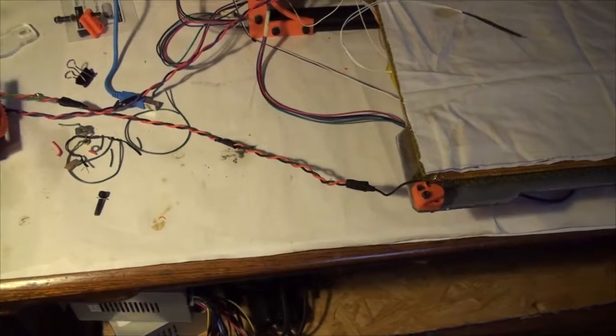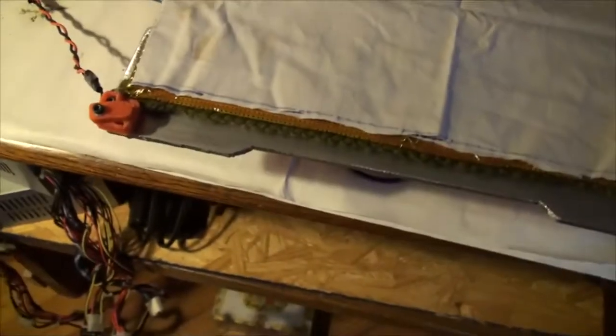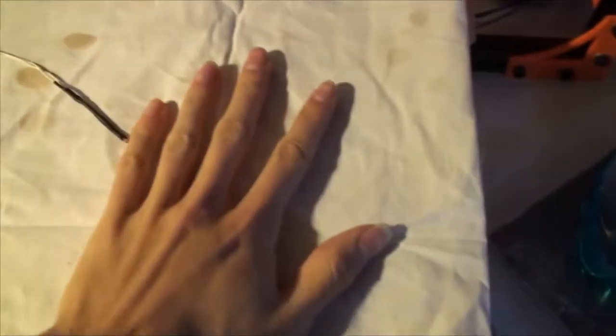Okay, I soldered some wires to my heater leads. I put down the insulating layer, that woven wool. And then I put down my heater, copper side up. Then my cotton insulation layer, which is really more like a heat spreading layer. And I have my thermistor here. So that's in place. And now we're just going to put the mirror tile on.